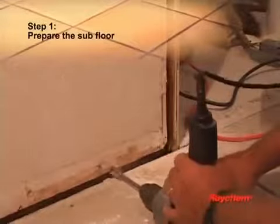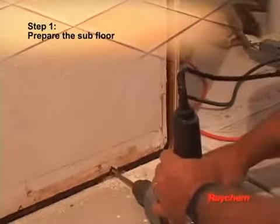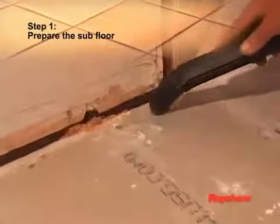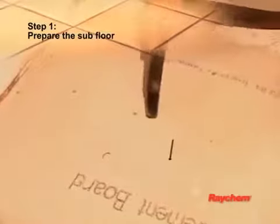Drill or cut a hole through the wall sill plate under the electrical junction box location. You will use this hole to route the cold lead and the floor temperature sensor wire to the electrical junction box. Be sure the floor area to be heated is clean, flat, and free of debris that can damage the mat, such as nails, staples, or protruding objects.